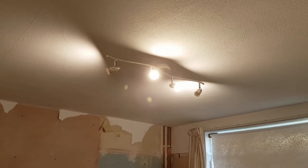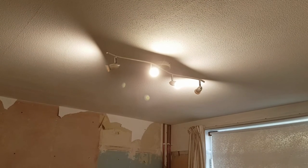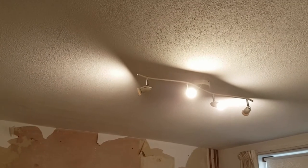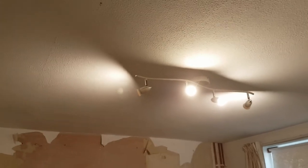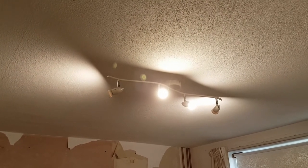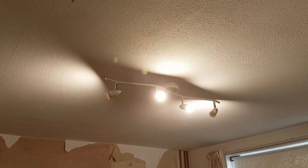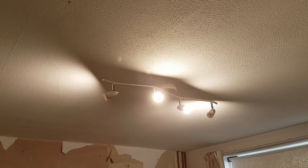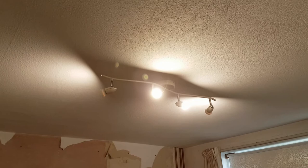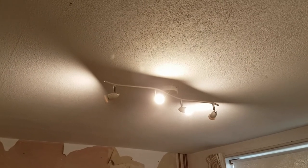It's not practical for me to stop working upstairs and then come down fitting spotlights. So my plan is, from above, to make suitable holes in the ceiling between two joists, so I've got a strip of spotlights there and another strip there. I'll make holes where the hole cutter's got to go and leave the cables up there with enough slack, to one side so they won't get cut when I use the hole saw. Then I can connect those without having to worry about his room above.